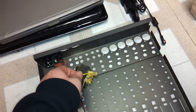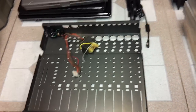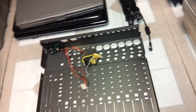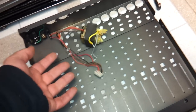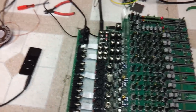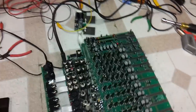But that doesn't solve the main problem — what am I going to do about the transformer? I cannot find this power transformer anywhere, so it's pretty much hosed regardless. It has a single center tap dual voltage supply, positive and negative 18 volts — that's not a problem, I can buy those transformers all day long. But it also has a 48 or 50 volt tap for the phantom power, which is the microphone power to preamps inside condenser microphones. If I just replaced it with a generic transformer, I would lose phantom power — it would have to be external. I did some eBay searching and I can't find that transformer.